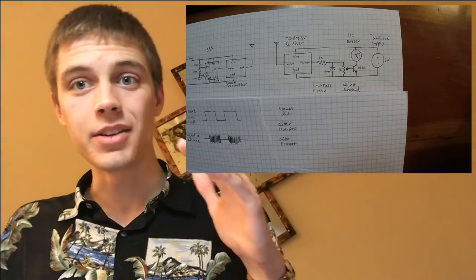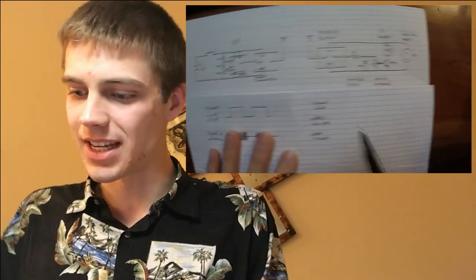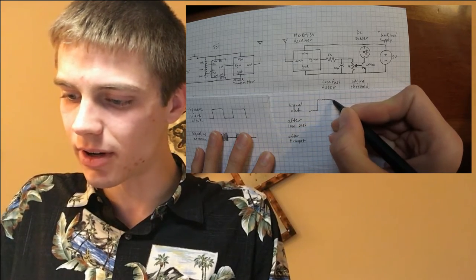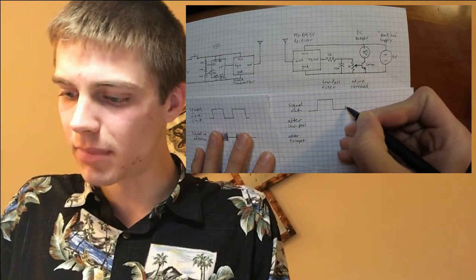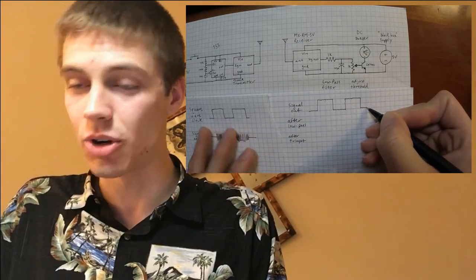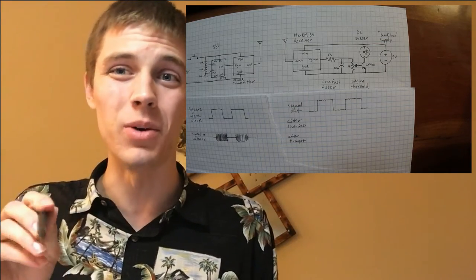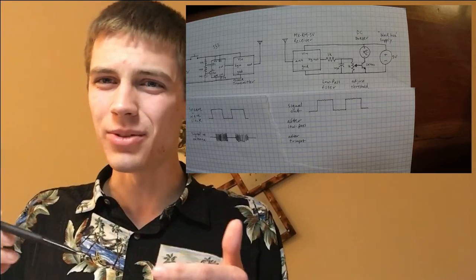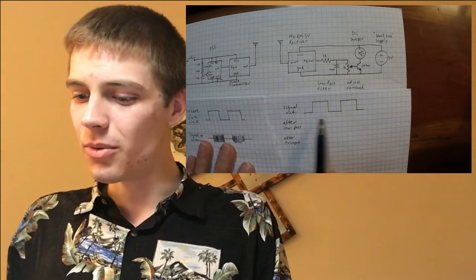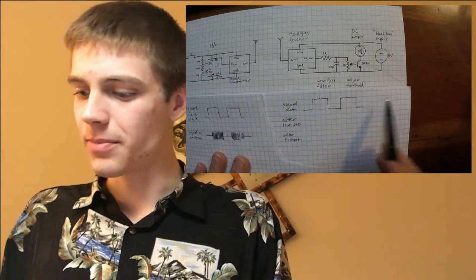So when the foot pedal is depressed, the signal that we get out of this receiver is kind of a noisier version of what we sent in. It's this same square wave, but of course, because we've transmitted it and received it and it's gone through a handful of stuff, it's maybe a little wavy at the edges. I'm not 100% sure how wavy, because I didn't actually have an oscilloscope on hand to analyze these signals. Instead, I was trying to use an FFT app on my phone and play all these signals through a speaker, which sounds really horrible, but it actually kind of worked to do rough analysis.